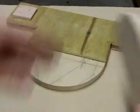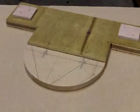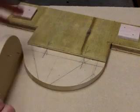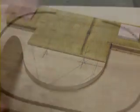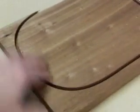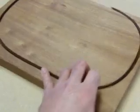They'll be identical, and what we'd be able to do is build them together like this to make a former out of the various sections. Then we can laminate some material over. As you can see, here is a nice piece of mahogany which we've put into the CNC machine, and we've cut this really nice shape out.